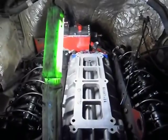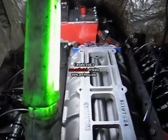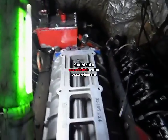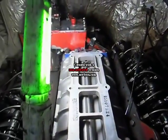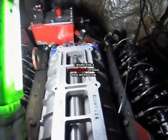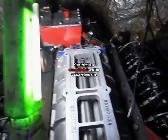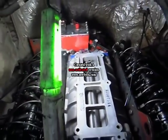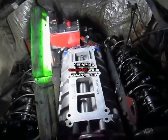I've just removed the air shutoff one more time and I'm going to start her up again. Now that I know it won't run away on me, I just want to rev it up a little bit and make sure that the oil seals aren't leaking in this blower. With the other one, the way you could tell they were leaking was when you'd start it up, rev it up a little bit, and shine a flashlight in — you could see the oil coming right off the seals down in there. So here it goes, I'm going to start her up and we'll see how this goes.